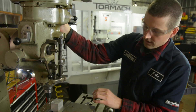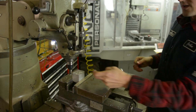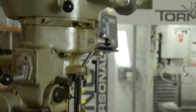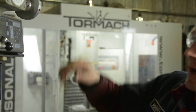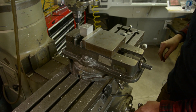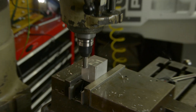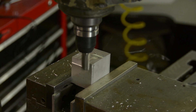We're cutting through metal right now — I think it's pretty cool. You want to try to be smooth with your motion; that'll make for a better cut. We'll stop the machine and if you feel that surface finish it is silky smooth — that's really cool, a really nice quality cut. So we sort of cut the top of it. Let's do a heavier cut and actually measure the accuracy. We'll unlock the quill and lower the tool down, then take a little cut off one side. You can hear — no chatter, real nice cut, nice and steady.